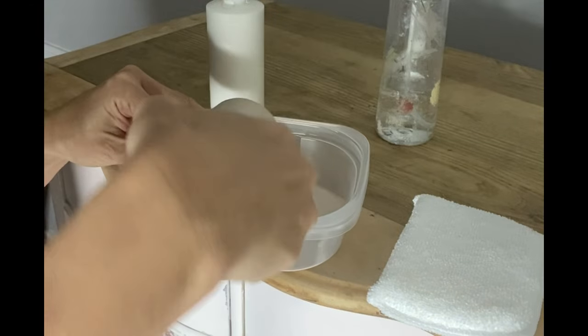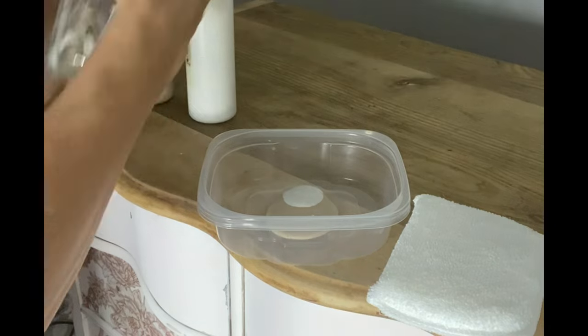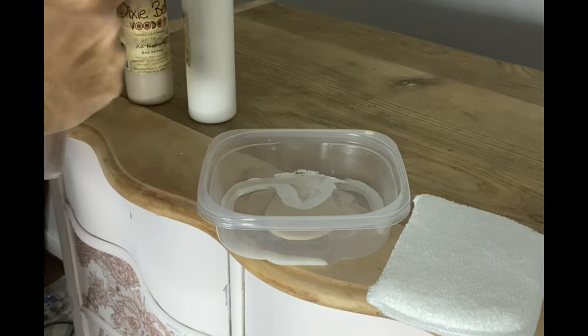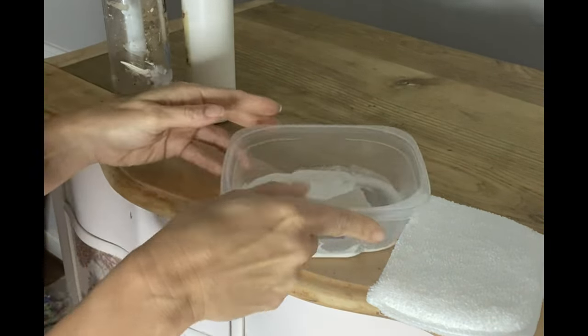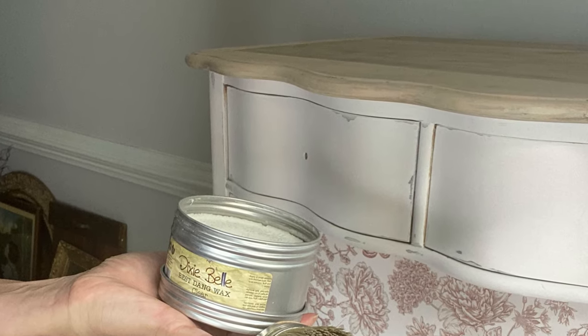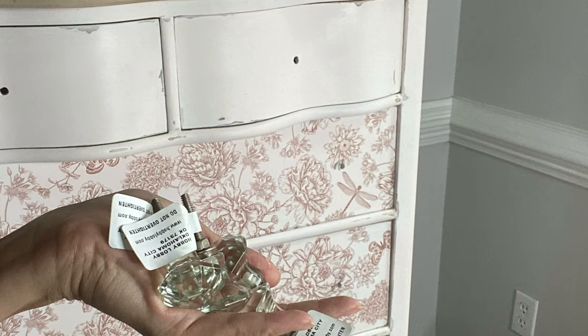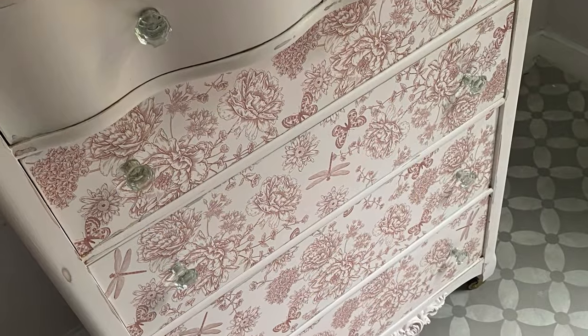Now that those drawers are finished, let's work on the top. I plan to use a little bit of Voodoo Gel Stain using the colors White Magic and Au Naturel mixed in with a little bit of water. I'm going to dilute the Voodoo Gel Stain and wipe it into that raw wood finish — this is going to give me a beautiful natural bleached-out look. I sealed the entire dresser, including the top where I applied the Voodoo Gel Stain, with clear wax. This is going to keep that finish looking beautiful and natural and seal in my transfers.